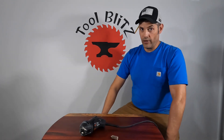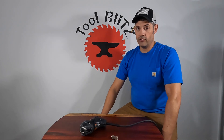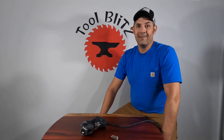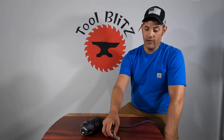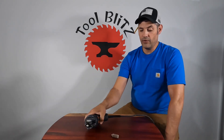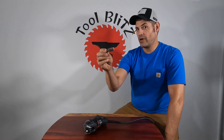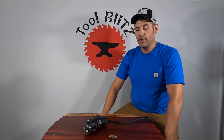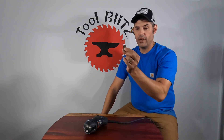A lot of these rotary tools run at very high speed. Think of it like driving in winter when you get frozen snow on one side of your wheel — you start driving and you have a lot of vibration because the wheel is out of balance. Well, when a light-duty tool like this is running this far out of true, we're talking about a lot of vibration that can destroy your tool.